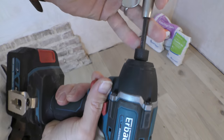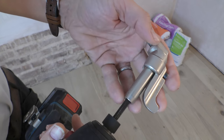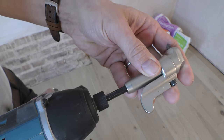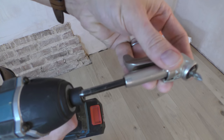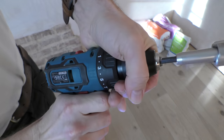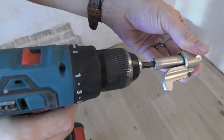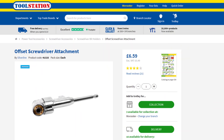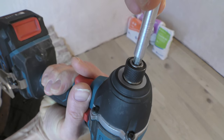One other point - I phoned up Wera this morning and checked with them because it wasn't obvious from the website, but you're not meant to use this with an impact driver. I have to say the build quality is such that I have used this with my impact driver - you'll hear the percussion in the video coming up shortly - but you're not meant to, and in fact it's not really designed for it because the collet chuck on the impact doesn't accept it and doesn't lock into place. So it's much better to use it with a drill driver. The last thing you want, particularly if you're on site, is for this to fall out of the drill driver when you're up a ladder and smash into a brand new floor below. Interestingly, the Toolstation version does have a better drive shank which would enable it to lock into place in the impact driver collet, as does the Wera high performance version.